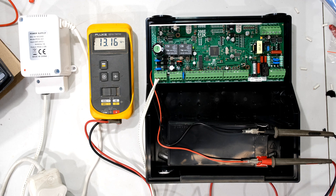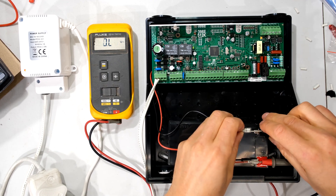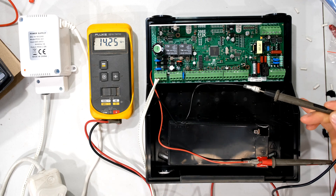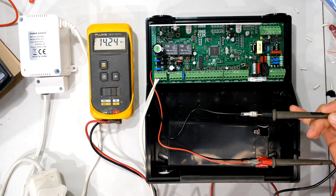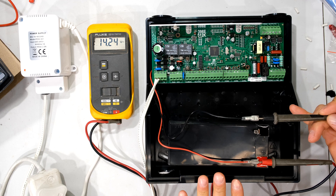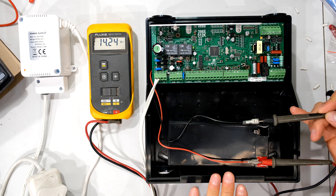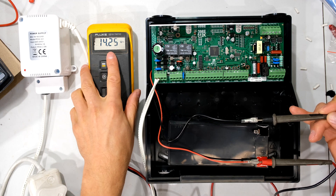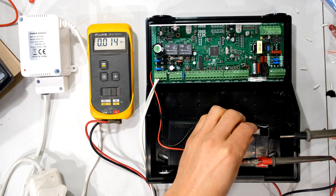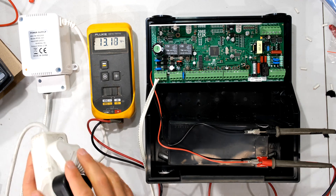Over the next hour or so the battery voltage will eventually climb to about 13.8 volts, because the battery is being charged. To charge a lead-acid battery you need about 13.5 volts or higher. Unplugging the battery shows the open-circuit charging voltage at the terminal is 14.25 volts — more than enough to charge the battery, since it's considerably higher than the battery's nominal 12 volts. To verify charging, you should be measuring above 13.7 volts; in this case 14.2 volts, which is great.